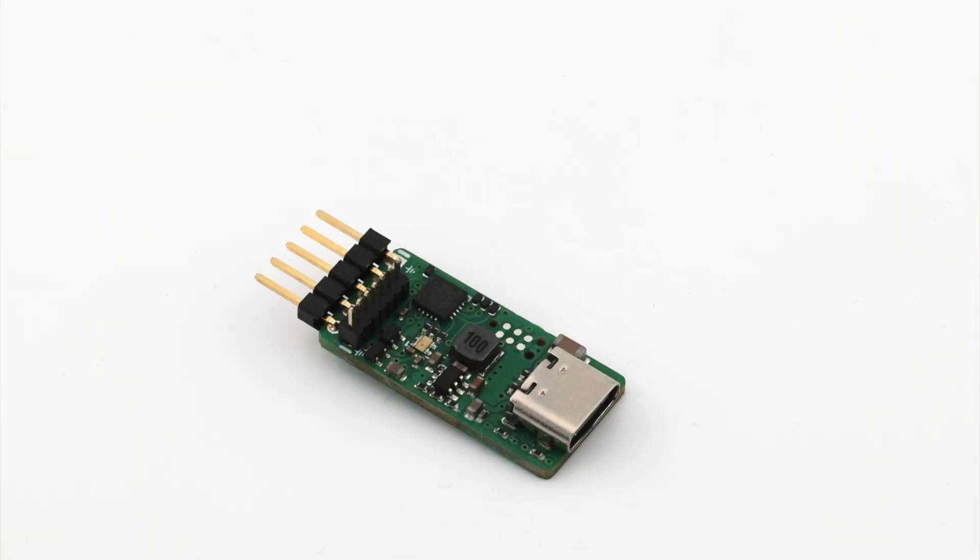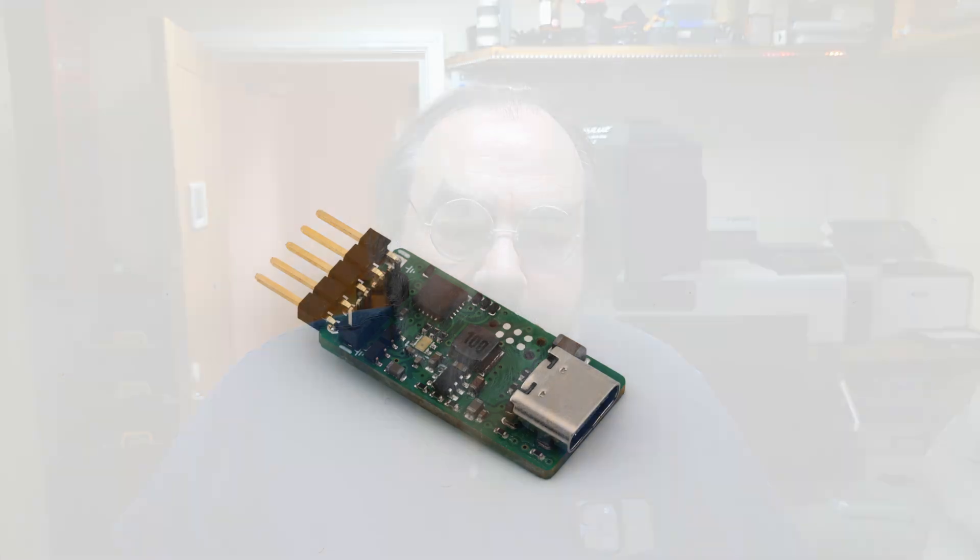The software — the ESP tool software for flashing these devices — knows to work the reset and the RTS and DTR lines to do reset and boot. It just does it. So if you've got an external UART, here's a board I use for flashing, and this connects reset and boot through the pins. The other alternative is a lot of boards will have a built-in UART and USB, but again just connect those control lines.